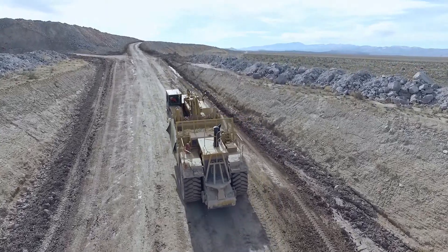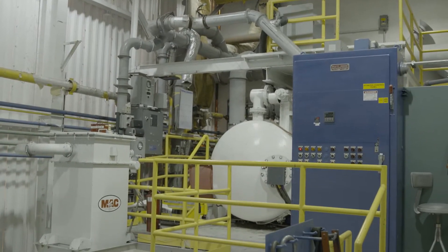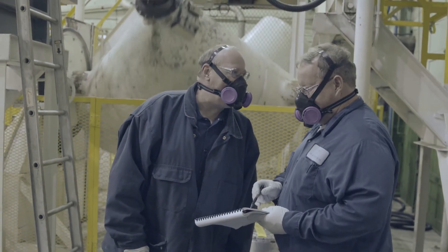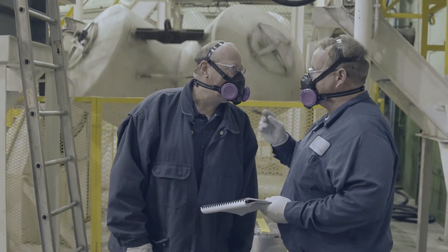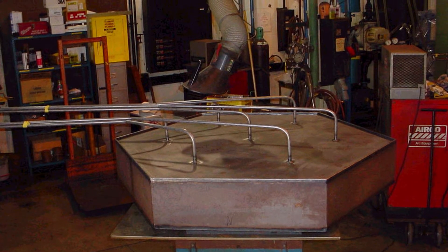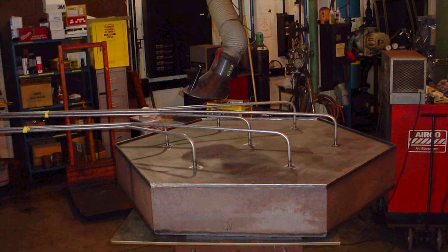We started on the mirrors approximately around 2006. The manufacturing process is very lengthy and detailed to make a beryllium optic. It starts with Bertrandite ore in the mine in Utah. We convert it to beryllium hydroxide in Utah and ship it to the Elmore site. At the Elmore site, we convert the beryllium hydroxide to beryllium metal. We make beryllium metal powder. It's consolidated in a specially designed container called a hip can, where it's consolidated into a hexagonal shape.